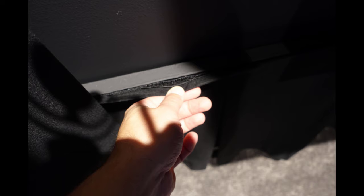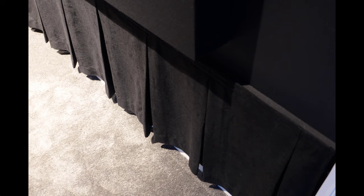She'd never actually made curtains for a home theater before, so she found it a pretty neat project. We went over the details, sheeted all the dimensioning and planning, and made the multiple curtain sections for the space. The curtains are attached to the walls first by putting black painted 2x4 lumber up on the wall screwed through into the studs. I then put sticky-back velcro along the top front edge of the lumber. The seamstress sewed the opposing velcro strip onto the back side top of the curtains, along with making the wavy pleated pattern that they have while they hang. The curtains then just stick velcro to velcro, and this has worked great. Although within a few months, some of the full-height curtains did begin falling down — they were pulling the sticky velcro right off the wall. An easy solution was to just nail the velcro strips in on the higher sections with a little nail every foot or so along the strip to secure it to the lumber. Nothing has fallen since doing that.